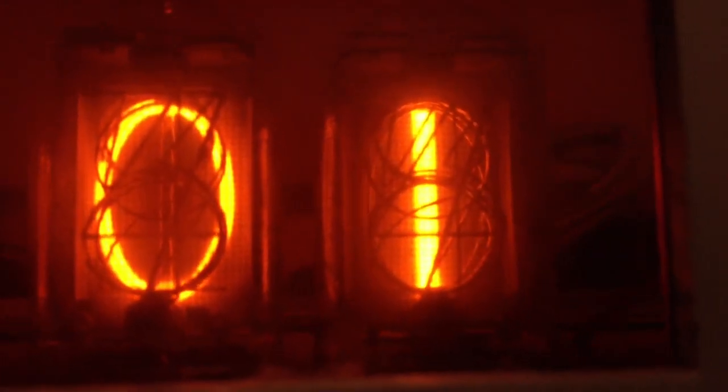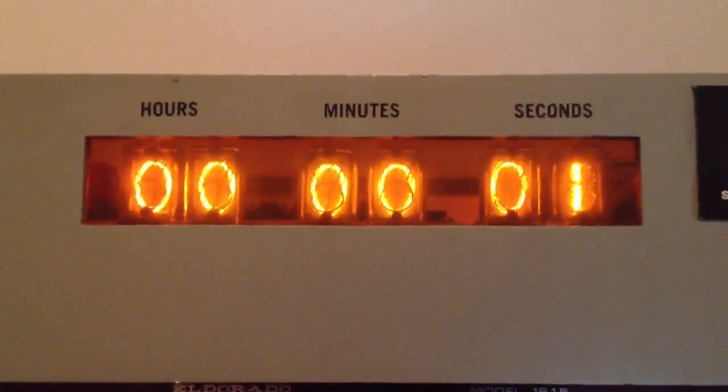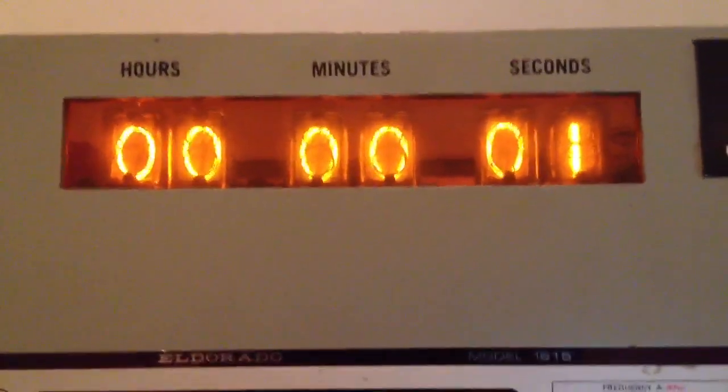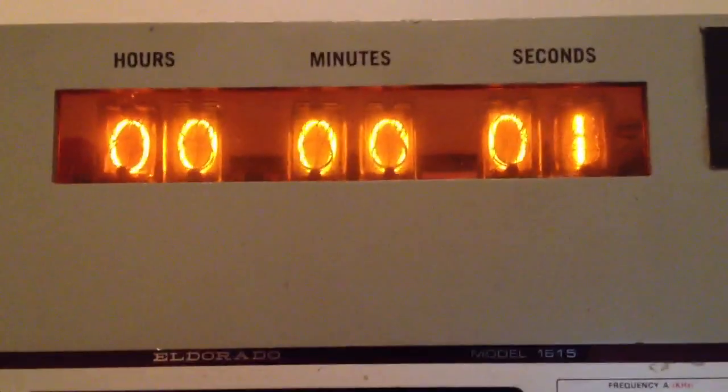But if you look really carefully at that lamp, it's trying for just a brief instant, probably 1/80,000th of a pulse to 0. What happens in XR3 is that if you send the same time signature twice, it's actually smart enough to say, oh, well, that's kind of screwed up. I'm just going to increment, because that would be the next logical thing to happen on the tape. I must have misread that, so I'm going to just increment it and wait for the next pulse. So it'll always be +1 if you repeat it over and over again.